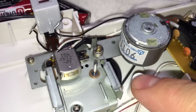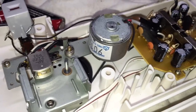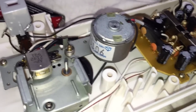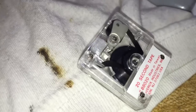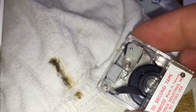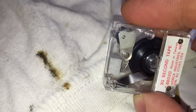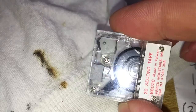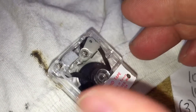The last thing I did was I replaced the belt that you see here. That's as far as the repair of the unit goes. Then I had to go a step further and replace the pressure pad on the little tape that it came with. Even after all of that effort and work, I still couldn't record, because the original pressure pad had rotted away inside this little tape. By replacing it with a new one, I was able to record.